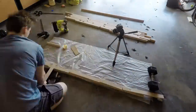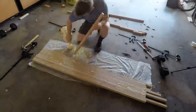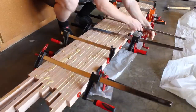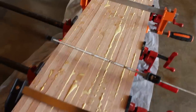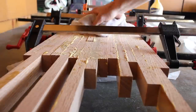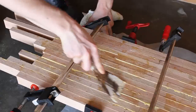I've never done a time lapse of a glue up before, but I chose to do one for this — so here is my 47 minute glue up all in 15 seconds. My memory card ran out of space shortly after this, but I used four pipe clamps to rest my desktop on and then used an additional seven clamps to tighten everything up. I think for the first time I might have actually had enough clamps. Once everything was tight and the glue had settled for about 15 minutes, I went back and wiped off any excess glue and used a scraper to get the bigger chunks off. I then let it cure overnight.